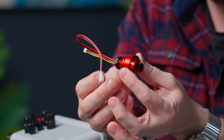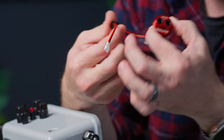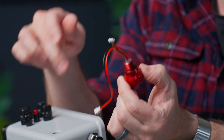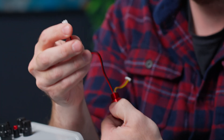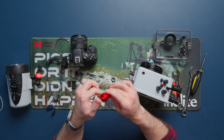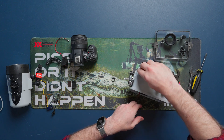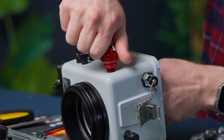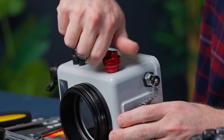On the transmitter you're going to notice the locking nut is also on here, which we will use, and then you'll notice there is a sealing o-ring — that's what corresponds to that sealing surface. Then you have two leads: this longer lead is going to go to the battery pack, and the shorter lead will lead to the hot shoe. We're going to take those two leads, simply feed them down into that half-20 hole, and then start the thread, being careful not to cross-thread.